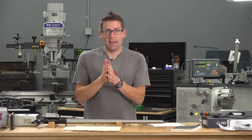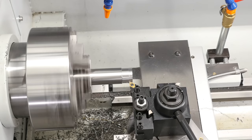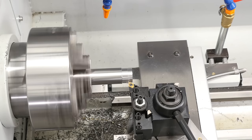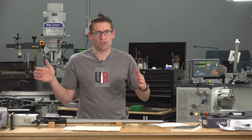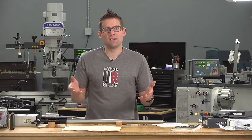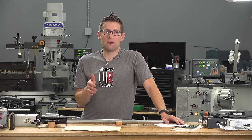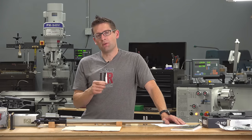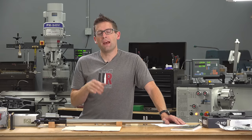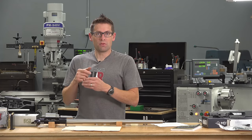Once satisfied, I moved on to the tenon work. I turned the tenon down with multiple light passes — when I've got a rifle barrel precisely aligned in the lathe I just take light cuts. I don't want to be in a hurry or push things too hard and shift the barrel or get things out of whack. This is bench-rest quality work and everything has to be absolutely spot on. I cut the tenon down to one and one-sixteenth. For threading I typically start at the major diameter; if needed I'll file down the tops of the threads, and the way the peaks look tells me how much further I need to go to reach the minor or root diameter.